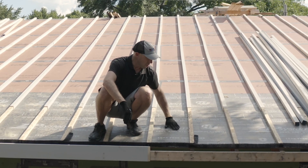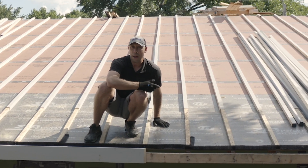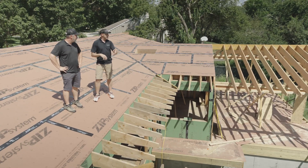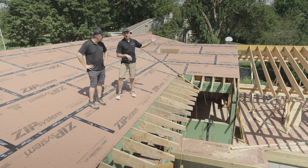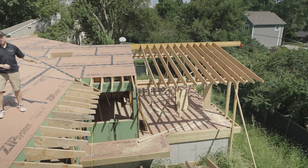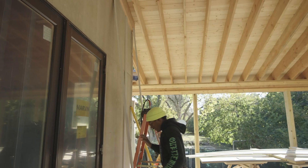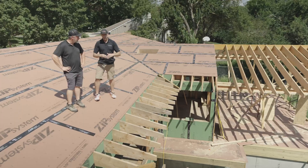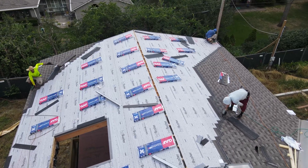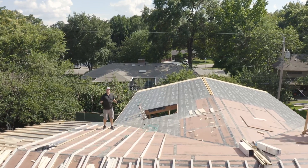By cooling this space, the cavity may only see 90 degrees, and now we're only dealing with a 20-degree delta-T at that interior ceiling. Follow me to the back side of the roof and we'll talk more about this. Over here we can see the exposed framing at our screen porch. This area is not covered with ZIP sheathing because it's going to have the same material as our soffit — we want it to read from underneath as finished wood. One of the real benefits of our over-roof strategy is that we don't have to worry about roofing nails coming through that material, because we've introduced the ventilation gap.